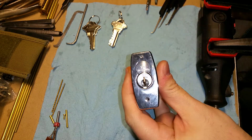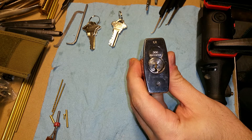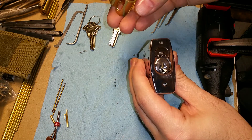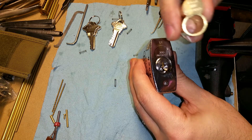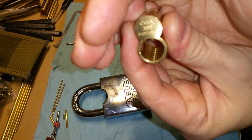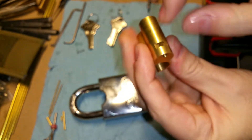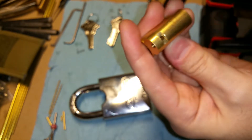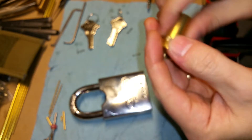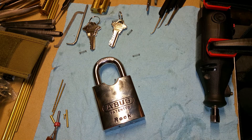I don't know what all the major differences are on the 83 core, but I do know a couple. On a typical 83 core, even the chrome plated ones, you usually see the C6A 300, and it comes with five chambers pinned up. The open one comes with the spare spring and spool pin and the cover, so that way you can turn it into a six pin lock. That's the way they all are.